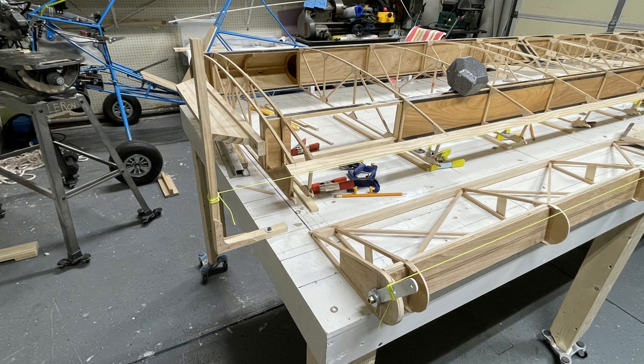One last thing: I don't like using lasers for this kind of alignment work. If you kick the tripod or bump the laser you have to start all over setting it up. I like to use string — you can kind of stand back and look at everything globally. With a laser you can't see the actual line unless you put material in front of it. That's one reason I love setting things up this way. Thanks for watching — please like, share, and follow, and I'll see you next time. Have a fabulous day, rock on!